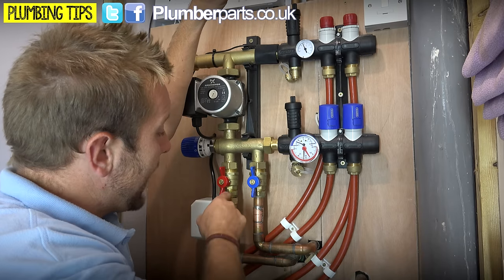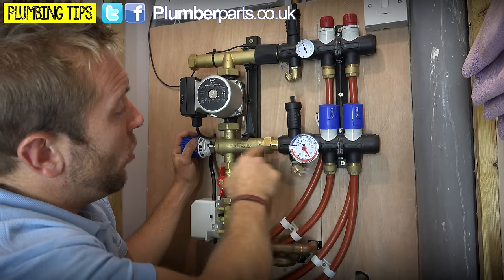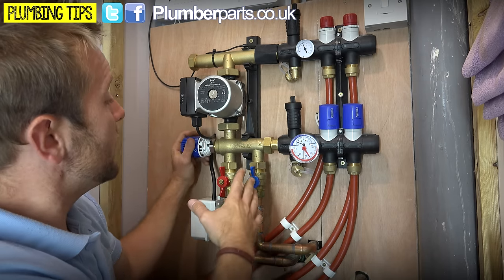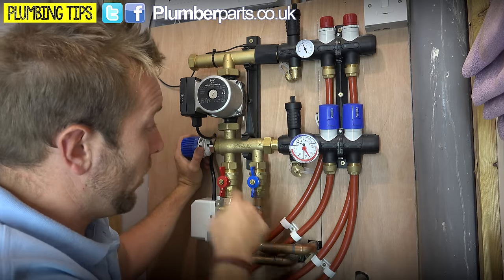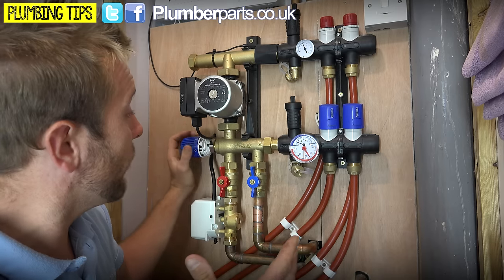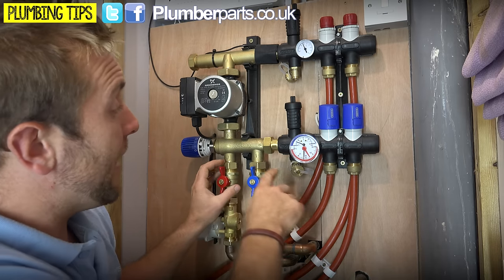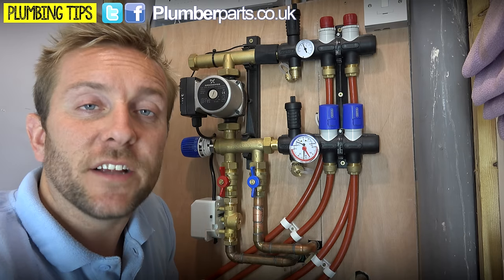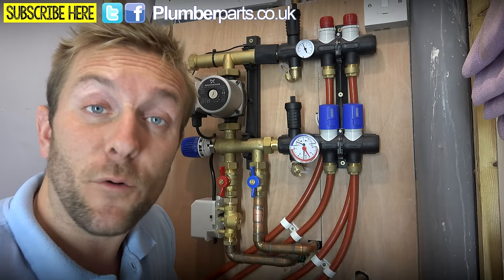So what happens when this system's operational and this is all being called to run? Now we're introducing 80 degree or 75 degree water from the boiler here, and that's getting mixed with the cold water that's going through here. As this senses and says, whoa, there's lots of hot water coming in here, in normal operation straight away it's going to run water through there and straight back down the return off to the boiler. Now, as it gets more comfortable with the temperature that's going through the underfloor heating system, and say it's asking for 45 degrees, this valve is going to shut off the amount of water coming in from the boiler and create almost a sealed loop from the rest of the heating system. And then every so often, as the heat dissipates through the floor and into the room, it'll allow a trickle of hot water to come through here and keep that temperature at a nice steady 45 degrees or whatever you've set it at.